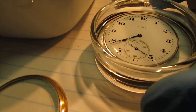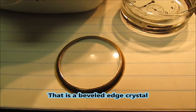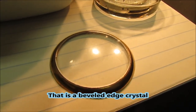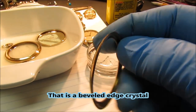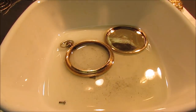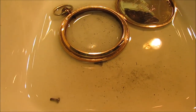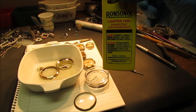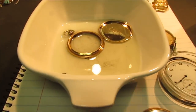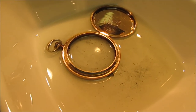I've got it sitting in some lighter fluid here. I took it apart. The crystal's in decent shape — it's not cracked. It's got some scratches in it, but it's pretty decent. You can see where, when I took the watch apart, all that junk — I flushed it out with this lighter fluid, and all the junk was gumming up the watch real bad, and it wouldn't run.